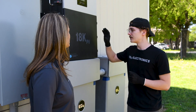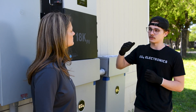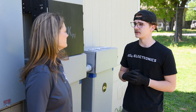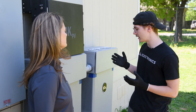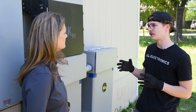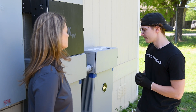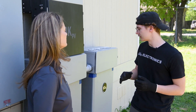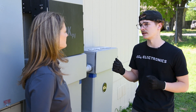The nominal AC output on this inverter is 12 kilowatts, and we can surge up to 15 kilowatts for around five minutes. This is an off-grid system, so we need battery storage. Each battery is 14.3 kilowatt hours, for a combined total of about 28.6 kilowatt hours. These batteries are very safe and very smart — they have built-in BMSs, everything communicates beautifully, and the cycle life is great.